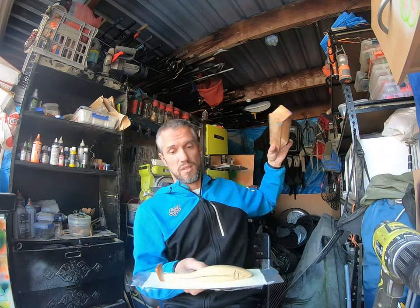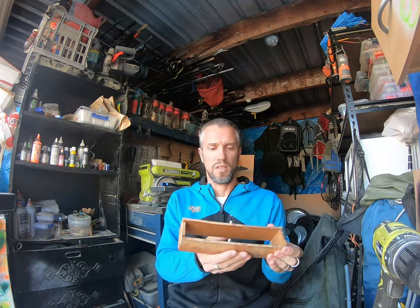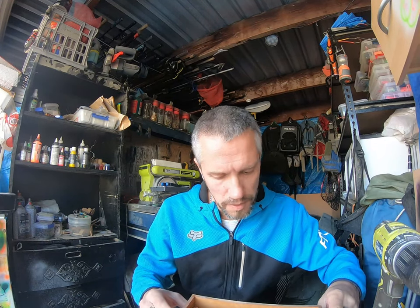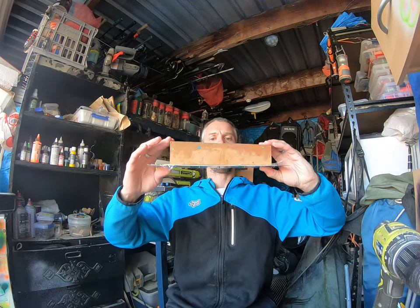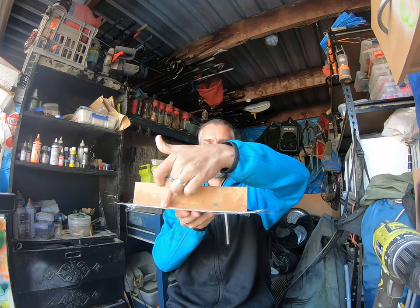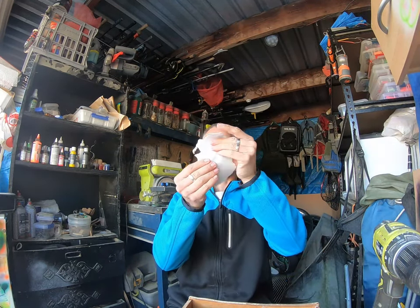Also, what I use for the mold is a box. And then you apply Vaseline all around it so the rubber doesn't stick to it. Place it over the lure like so. Now, what you need to do after that is make sure it's on the right way as well, it always helps. Run some plasticine along the edge here so there's no leaks. I have had a couple of major disasters while I've been doing it and made myself some non-slip matting, which I really didn't want to do.